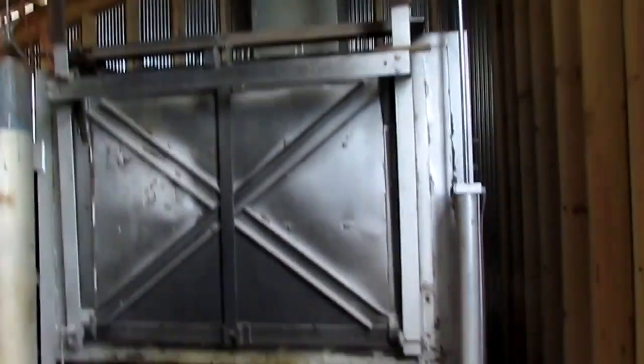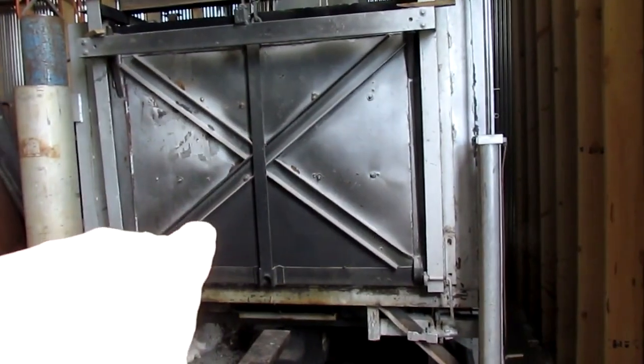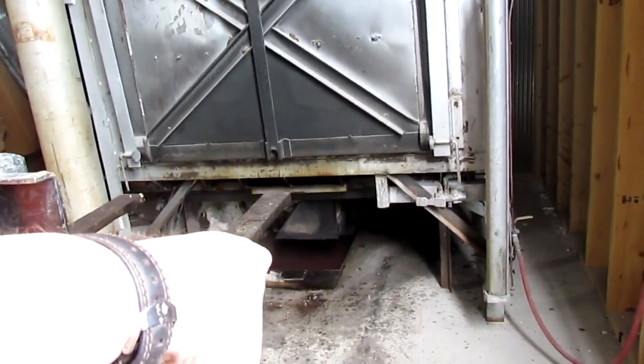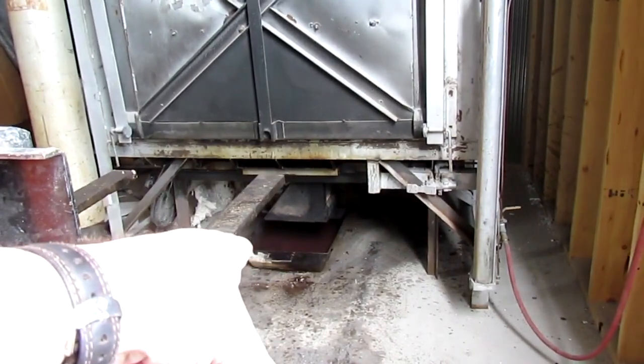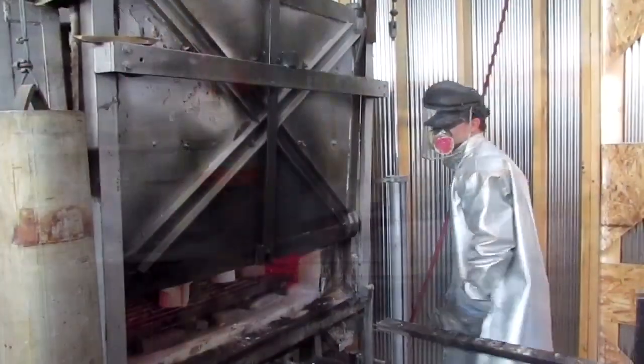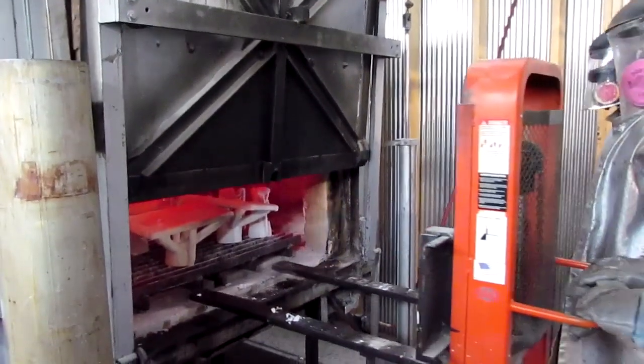This is where they cast the bronze. Okay, so we come from where that sand is to this step. Now they take the ceramic molds and they put them in this oven here. That melts the wax out, and the wax pours down into that pan. And they can reclaim the wax. Oh, so now you have that hard vacant hole. Shell. Yeah, I'm going to take the molds that have been heated up to 1400 degrees.